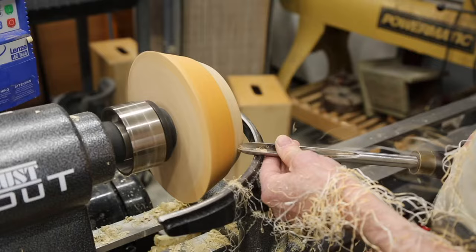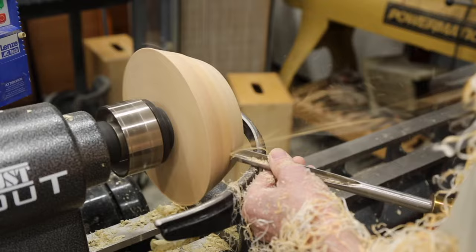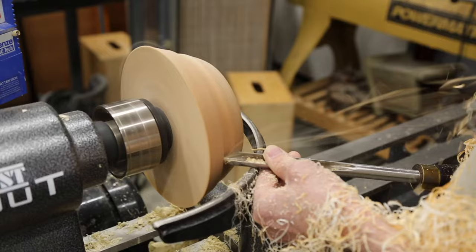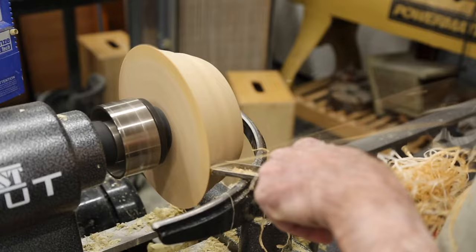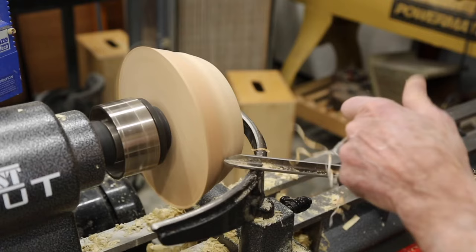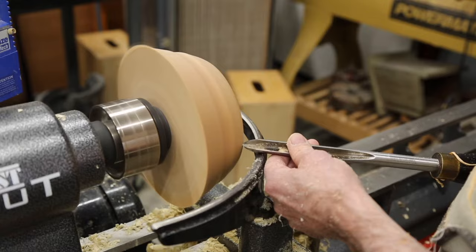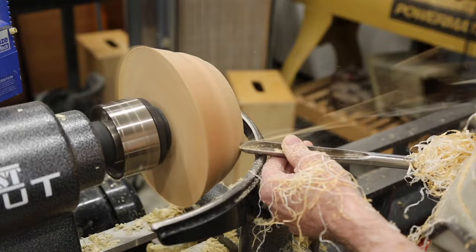We change directions with a bowl gouge: if we want to cut deeper we need to swing it towards you, and if we want to cut shallower we rock up and come around and continue right up the wall. If everything's right, you only need downward pressure on the rest — all the control is in the handle hand. The start position is 9:30 or 2:30, and the scrape cut, once going, twisting the gouge clockwise on an outside cut or counterclockwise on an inside cut, makes it come sweet.